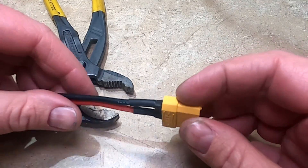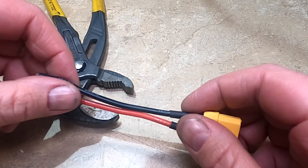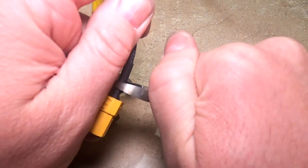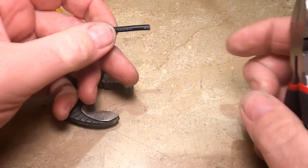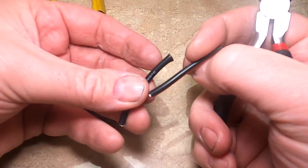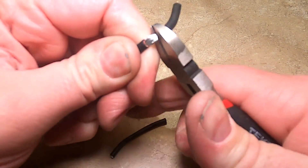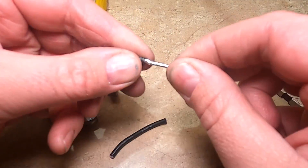So that's it — that's how you solder on new connectors. Now I'm going to show you how to connect two wires. I'll just cut this wire and solder these back together. For this you're going to want to strip almost about an inch and just twist that. Same thing on the other wire.